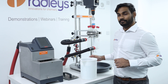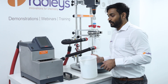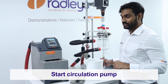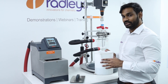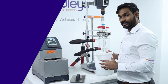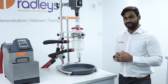Now that we've got everything connected up, we can start filling our circulator with thermal fluid. As we're using a Mini Stat, all I have to do is simply pour the thermal fluid into the bath. Now we can start the circulation of our thermal fluid around the jacket. Make sure that you have another jug with thermal fluid to hand so that you can keep topping up the bath as the liquid level drops as it fills the jacket. On your initial filling of the system you may see a little air gap at the top of the jacket.